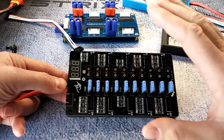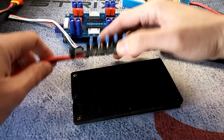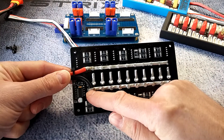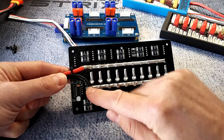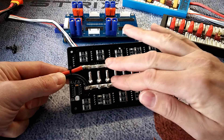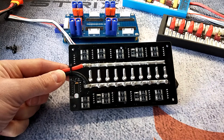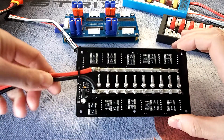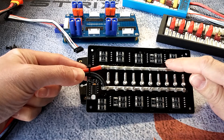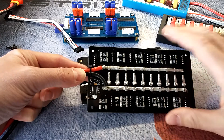From the outside everything is built pretty well, but it's the attention to detail that matters. I pulled out the six screws and basically pulled this board apart. On that cheap board, these two wires that come into the printed circuit board heated up — one of them broke loose from the solder joint, they touched, and without any built-in fuse the battery fueled the fire and melted the traces. On this board I looked at all the solder joints — pretty hardy, pretty good. I don't see any slop in the solder joints, all pretty solid, no issues.